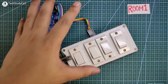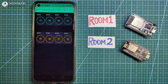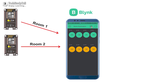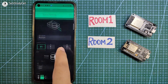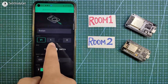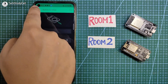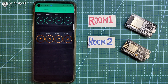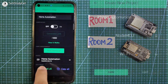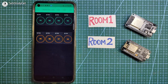In this project, for room 1 I will use this circuit, and for room 2 I will use this PCB. I will use the same Blynk project created in my previous video to control two NodeMCUs using the same Blynk account. You can find the previous video link in the description. In this project, if you tap any button, you can see I have used virtual pins. To turn off the relay I will send 1, and to turn on the relay I will send 0, as I am using an active low relay module, and mode is switch. In this way, you have to create 8 buttons using virtual pin 1 to virtual pin 8. And while creating this project, I selected the device as NodeMCU, but as we are using only virtual pins, we can control any microcontroller with this project.